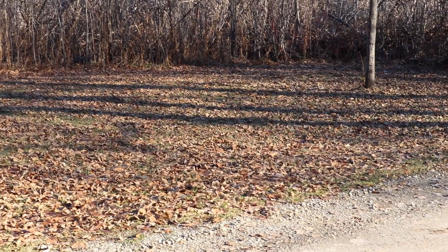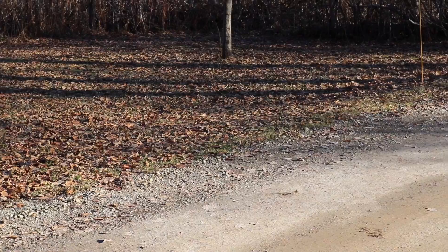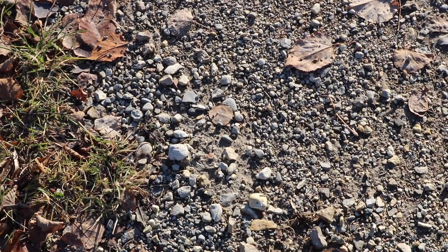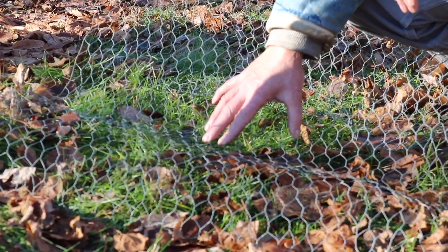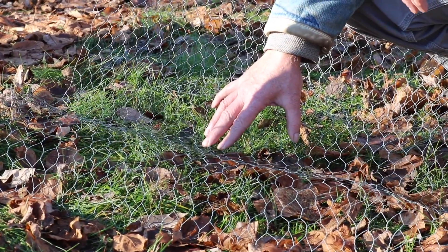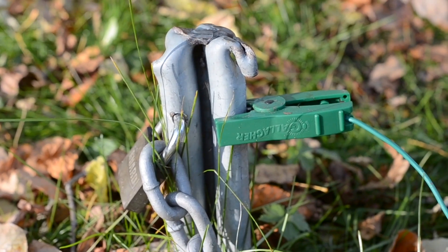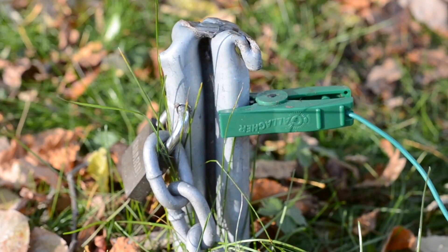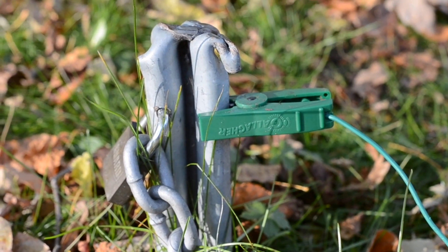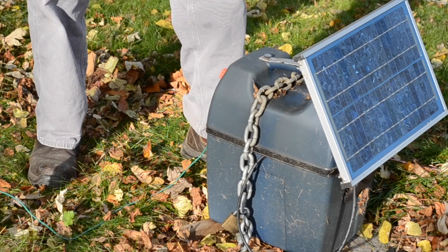If you're in an area that's really dry — for example a gravel pit or sandy location — you may need to provide grounding for the bear's feet. You can do that by running chicken wire around the perimeter of the fence, attaching it directly to your ground rod. The ground rod is connected to the negative on the fencing unit, and that way the bear is grounded out even in dry conditions.